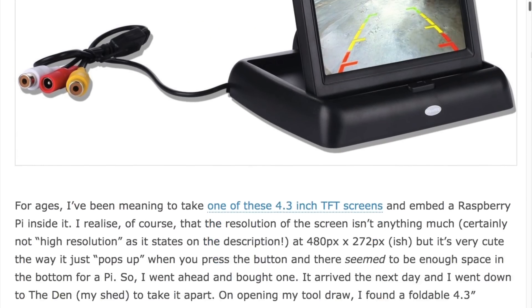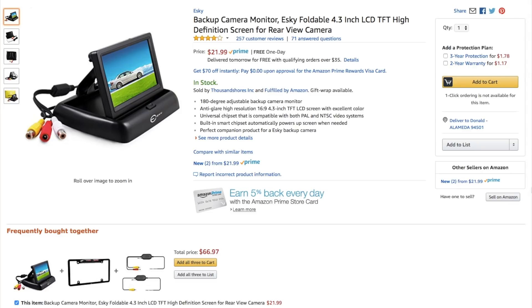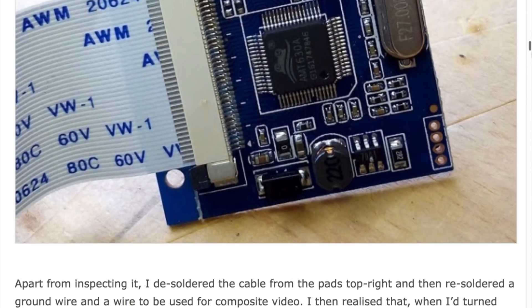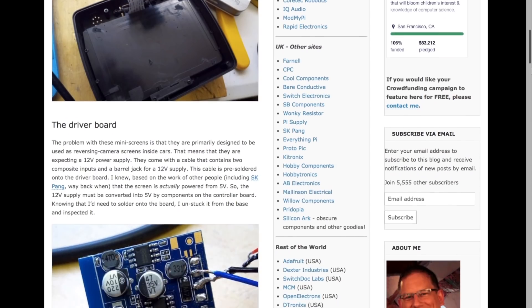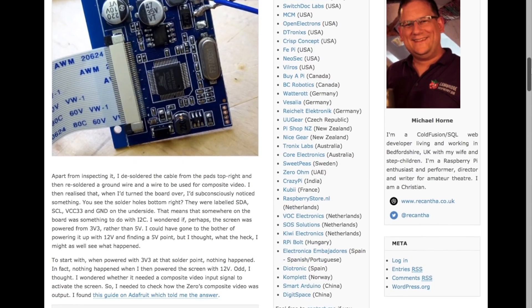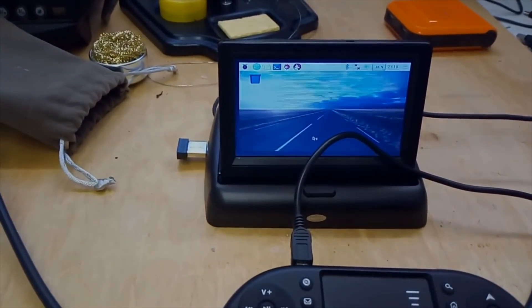For a quick and cheap way to add a screen to a Raspberry Pi computer, check out this guide by Michael Horn on combining a pop-up rear-view camera screen with the Raspberry Pi Zero W. The screen costs around $22 — I'll include an Amazon link in the description. It runs off composite video input and 12V DC power, perfect for a car's cigarette lighter socket but not ideal for the Pi. After some investigating, Michael found that the screen actually runs off 3.3 volts after you bypass some of the electronics. His thorough guide shows you how to power both the Pi and the screen using a single 5-volt adapter, driving the screen from the Pi's 3.3 volt GPIO pins. It's a cool and straightforward hack — great for a cheap terminal setup, a portable game system, or an exhibit screen that plays video.